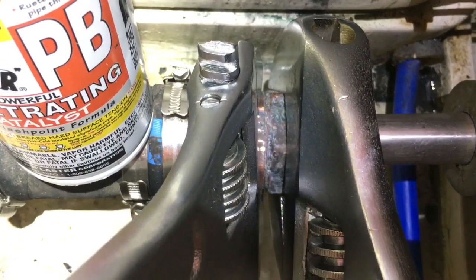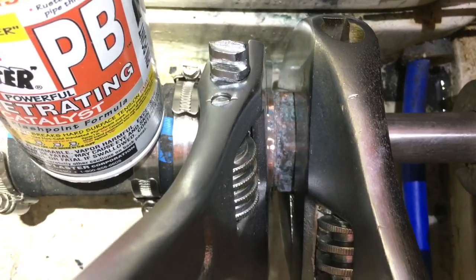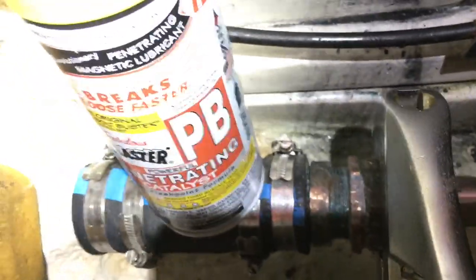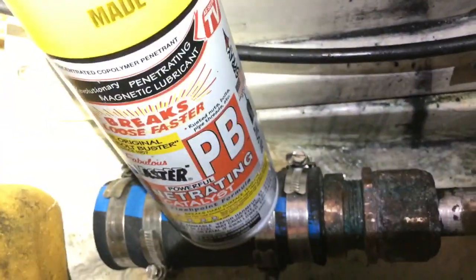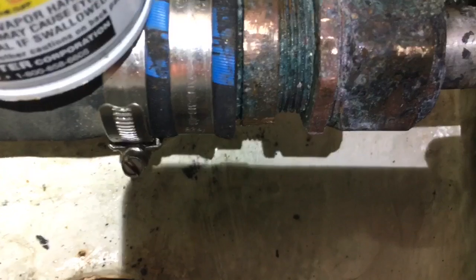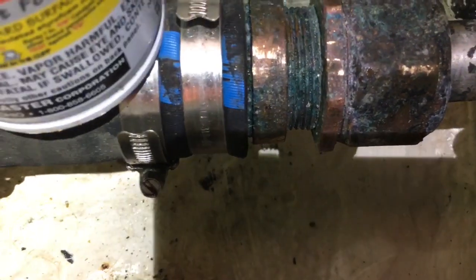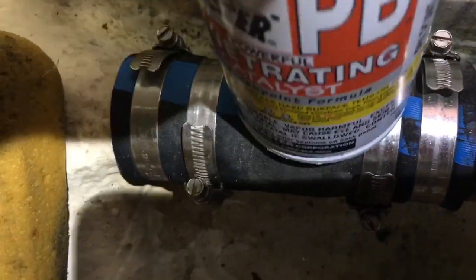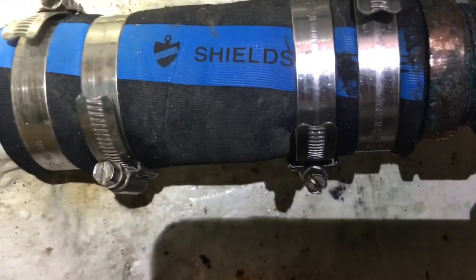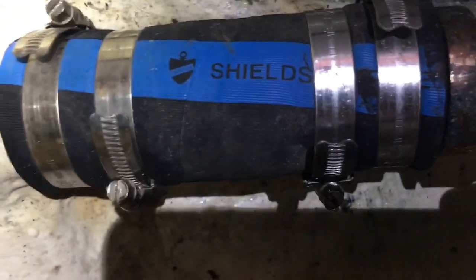I think this adjustment is done. Ideally, you'd clean this nut up every so often — I've got a lot of corrosion on here now, which is a pain. I could sand the nut and get it cleaned up. Also, the shaft log tube — if you're going into the yard, make sure it's in pretty decent shape because it does get a little stress on it. You can see from the positioning here that I've stressed it.